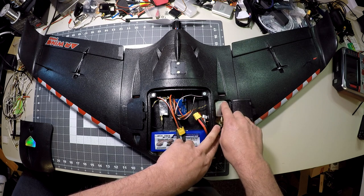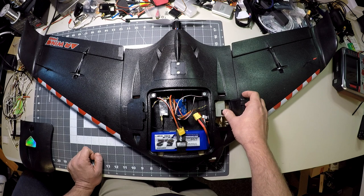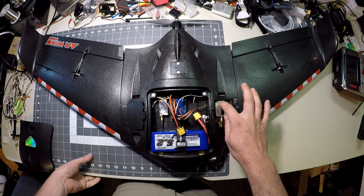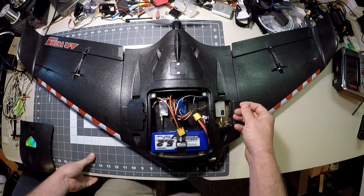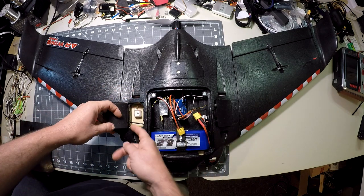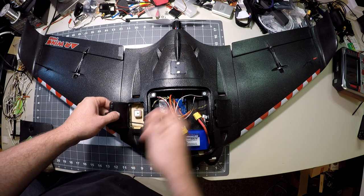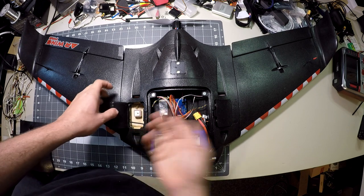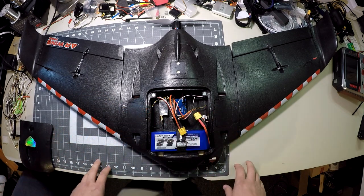The back of the transmitter sits into the cutout where airflow was supposed to exit this bay, which impedes airflow a little — not ideal but adequate. I've done some pretty long flights and always check it when I land, but the transmitter runs totally cool, barely warmer than ambient. On the other side, there's a smaller cutout at the root for the Dragon Link coax, so I was able to use a straight-through connector there — I just feed it through and connect it up.